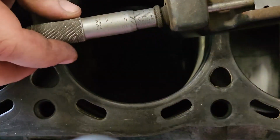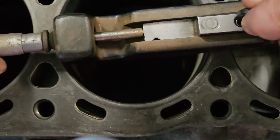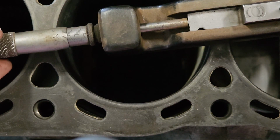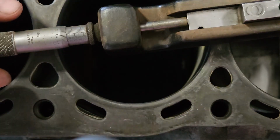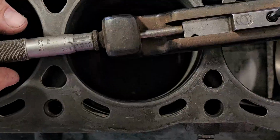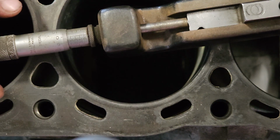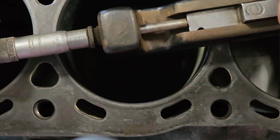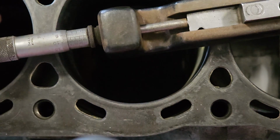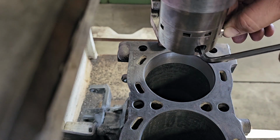So here we go, so you can zoom in and see me do this. We're going to loosen this screw, and then we're going to tighten this, let it out, and then kind of just lightly push it in place so that it's kind of set. Back to zooming in to 650. I go just a tad bit over, lock it down. Close enough, I don't care. 651. It's not the finished pass. So we're gonna run that 651. So I got my tool in and lock in place.